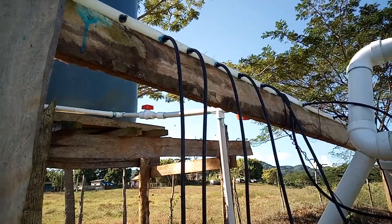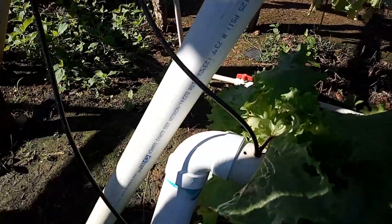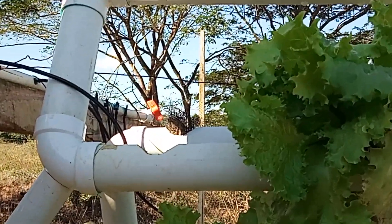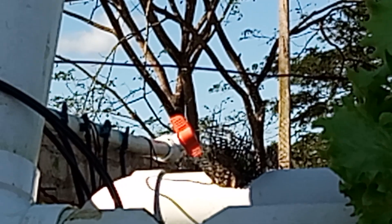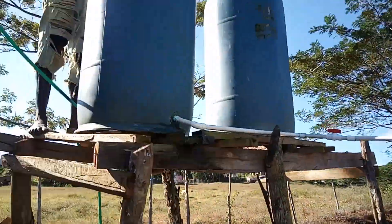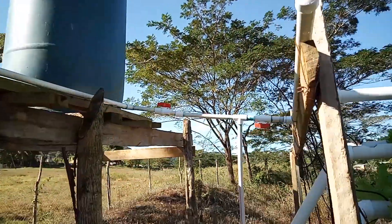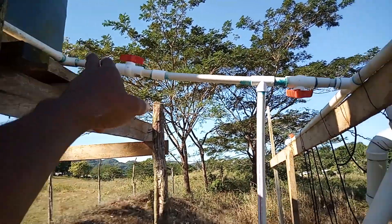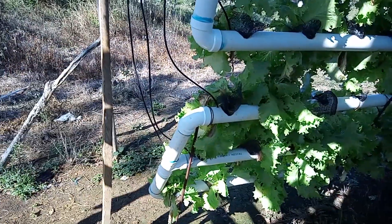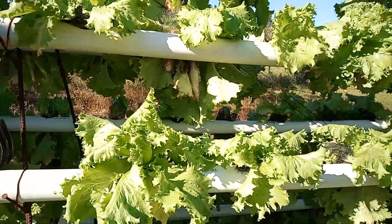Every pipe has a micro tube — that's where the water runs down from. Over there you can see a red top lock-off valve. If the system is clogged, we open that and clear the pipe and the tube. These drums up here are the gravity-fed drums, so once these drums are full we turn off the pump and let the water from the drum go back through the micro tubes and into the big tubes on both sides.